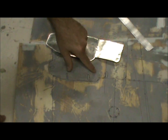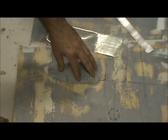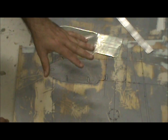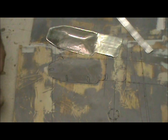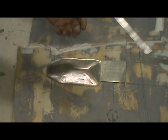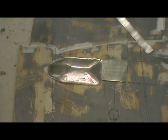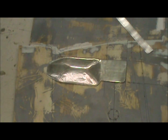Since these were 3D printed, I could have gone through and made a press fit form of this by shelling it out to the thickness of the metal, making a female and a male part, and then just going kaput with a piece of annealed metal, and there you go. But the plastic from the 3D printer probably wouldn't hold up to that very well. Even for just one or two pieces, it wouldn't be strong enough, or it would take so long to print the parts that it'd be way longer than just doing what I showed you guys.